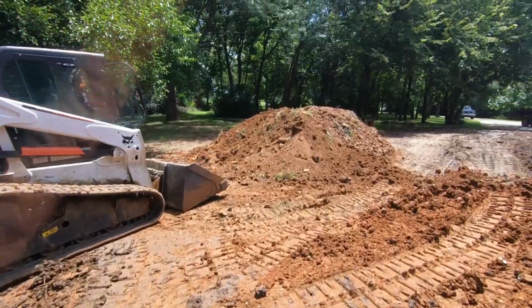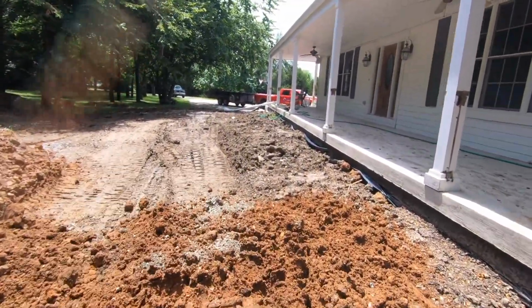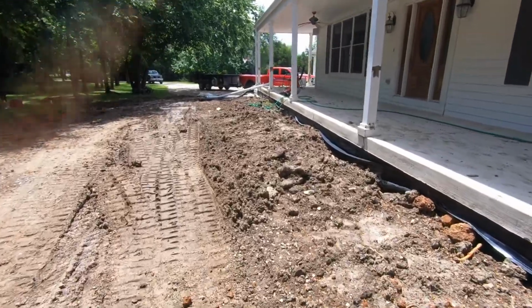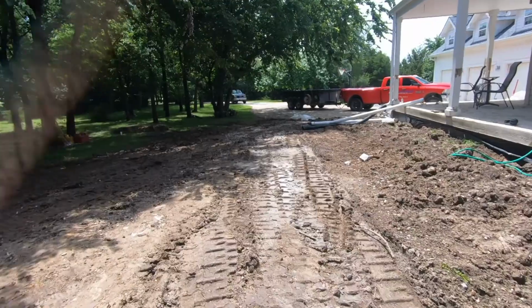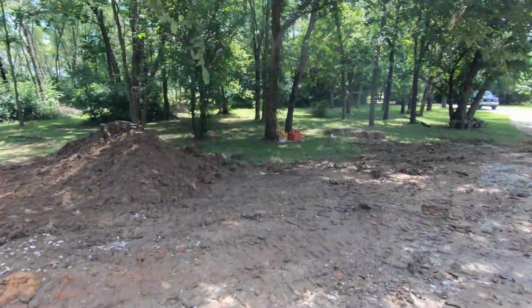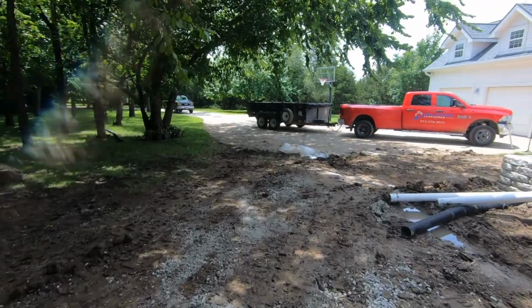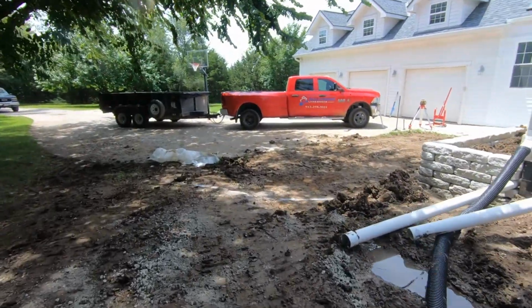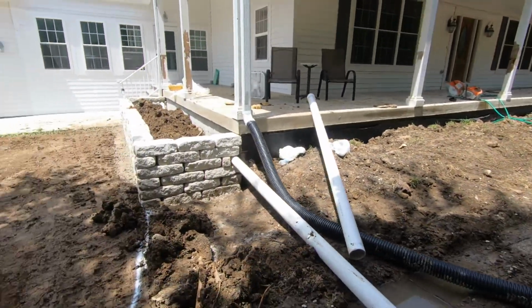And then up here, Warren's gonna take all this clay right here that we imported, about 75 cubic yards, put it all along the front, raise all of this up. And then on Monday, hopefully that topsoil pile will dry out a little more. We'll bring that in, and we'll probably import about 20 cubic yards of screened topsoil just to put on the top. And there's the wall.